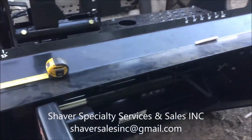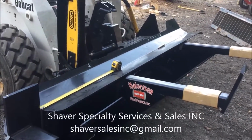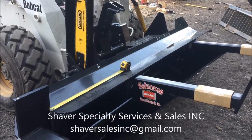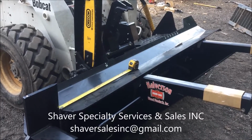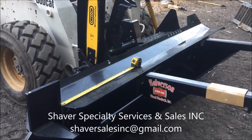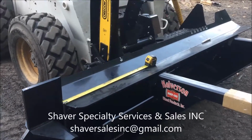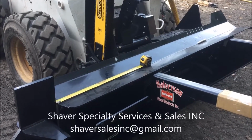Now how this works, when the splitter table backs up, the new proximity sensor, which I'll show you, stops the table at a set increment. You design and you set that increment, what is good for you. Hopefully we can get this set at around 16 inches for our new customer. We're going to try that out here in a few minutes. So again, as the table backs up, the new system stops it where you set it.